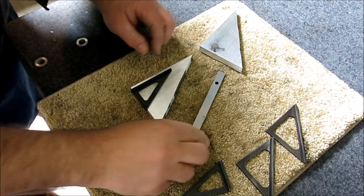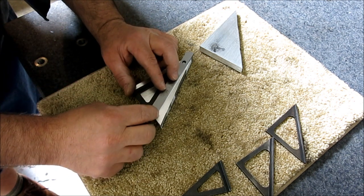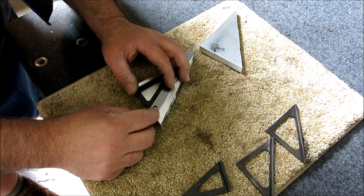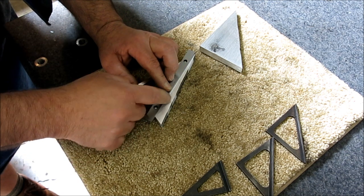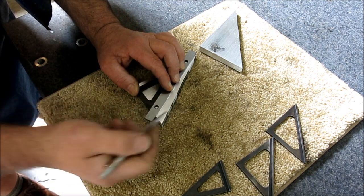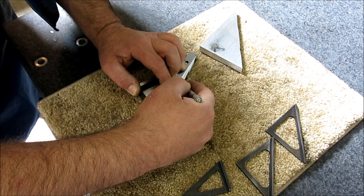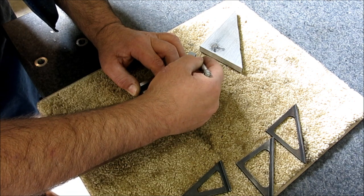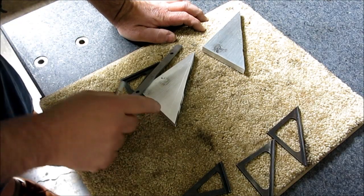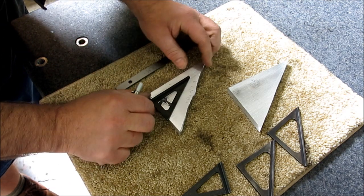So we're going to use Stan's little triangles as our guide. And as you can see, the angle on our fine aluminum square here is not that good. So let me get a little scribe on there. And then we're going to bandsaw that to start with. Let's do this one too — we'll bandsaw that.